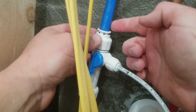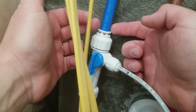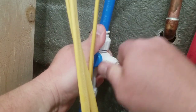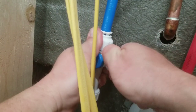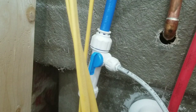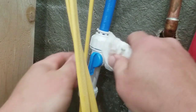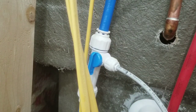On the top connection, the PEX pipe didn't quite reach an inch and a half either — that's as far as it's going to go. I hand-tighten it down; I had loosened it a little before inserting the pipe. My hands are a little slippery from some water that got past. That feels nice and tight now, so we'll move to the refrigerator side.